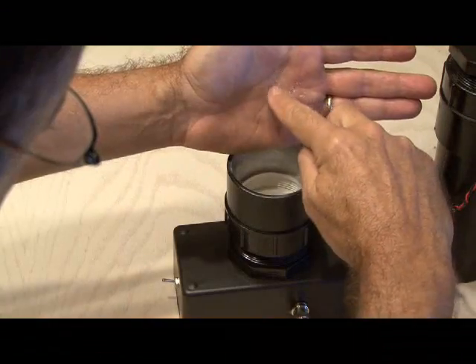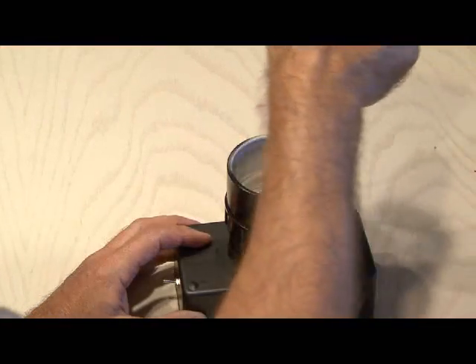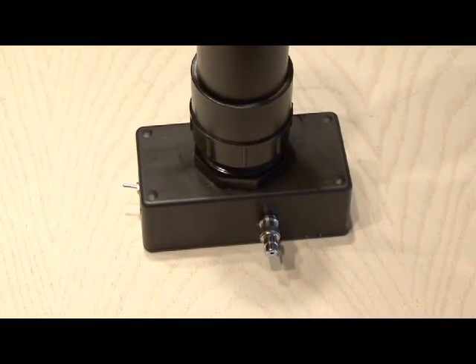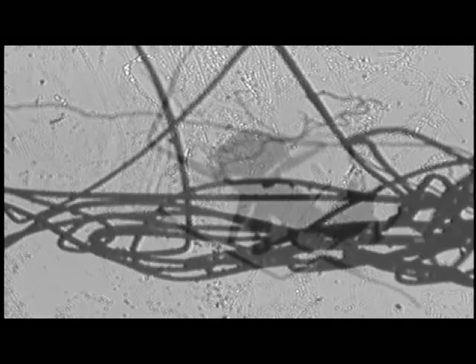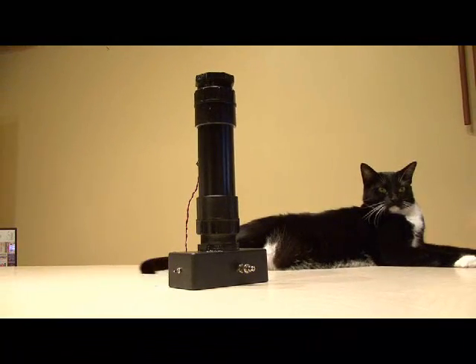We are about done. The first specimen we're going to try out is just some regular table salt. I sprinkled a little table salt in, and we take our microscope tube and place it in our base. The last step is to hook up a video cable to our lensless microscope — and here are the test results. This works really well and it's very clear. You can see the salt crystals perfectly. I also tried some human hair, a very tiny ant, and the scraping off of the inside of a cheek. The ideas are almost limitless of the things you can inspect under the lensless microscope. It's fun and easy to make, and we'll see you next time with another weekend project.